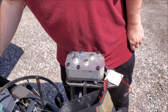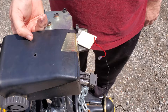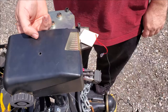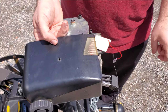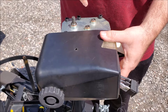Once I got the first switch off and had a little more flexibility, I reached up inside the case, used my thumb to squeeze the bottom of the defective switch, pivoted it out just slightly, then really mashed down with my fingers — you can't use any tools, there's no room — and was able to pop it out the front. At this point, victory! But I'm not going to start pulling the wiring apart until I've taken photos with my phone to make sure the switch and wires are oriented exactly the same way. These blade connections have never been removed since the factory, so jiggle the connection as you pull it off. If you just grab the wires and yank, you could rip the wires right out of the back of the connection — especially a disaster during lockdown when hardware store access is limited.